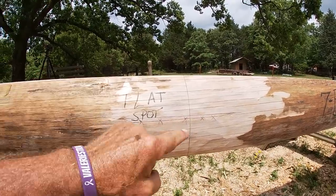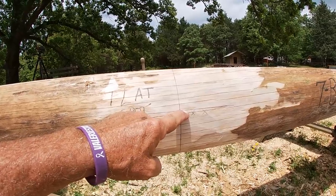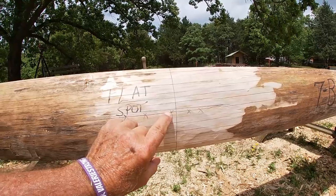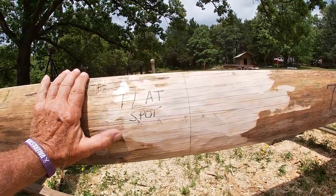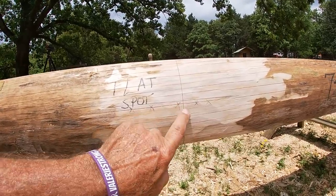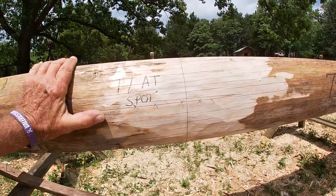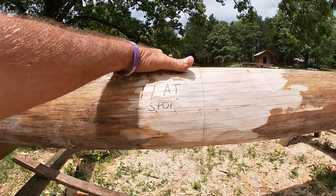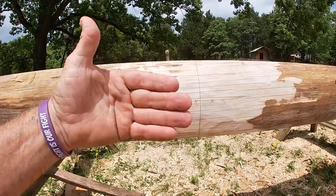And there's some X's below that line. What I'm going to do is take a chainsaw and make a plunge cut below this line. This line is 2 3/4 of an inch from the inside face, and I will use either a 2x3 or a 3x3 piece of 1/4 inch angle iron, and one side of it will go in the slot that I'll cut, and the other will be on the side there. And it goes all the way to the bottom of the opening, and I'll plunge my saw through far enough into the log that I know I have enough room for this log to settle.